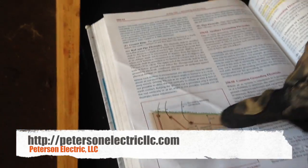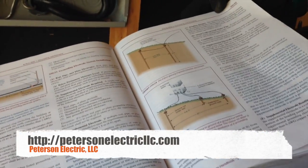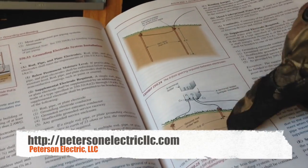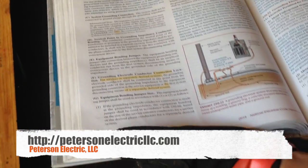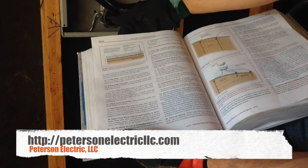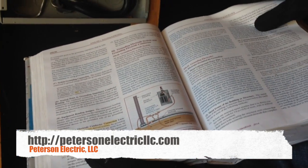Right here it's going to talk about this — this is the handbook of the 2014 NEC. Right here it talks about the grounding for your ground rods, not closer than 6 feet apart, and how far you drive it is going to be 8 feet. This is referring to Article 250.52, at number 5. Also when we're dealing with your grounding installation, they're talking about a water bond — that's going to be 250.52.1.